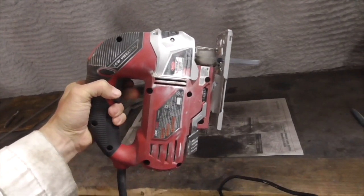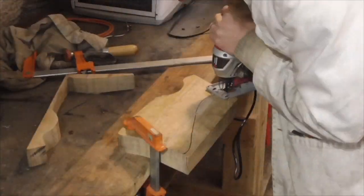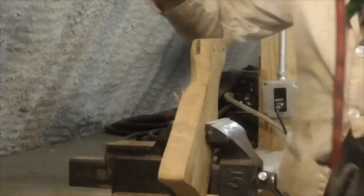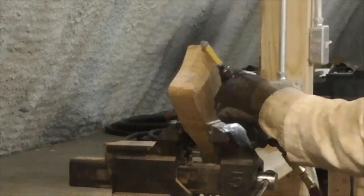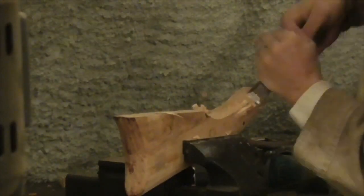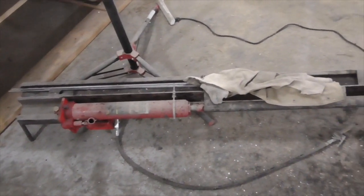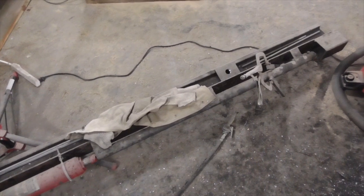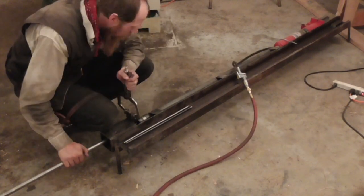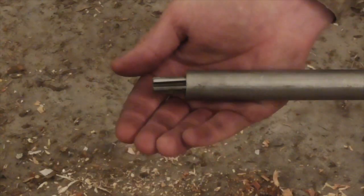If I want to make a wooden stock or something, then I need some woodworking tools. Usually I'll start by cutting out the profile of the stock with a handheld reciprocating saw, then carve the stock using a router trim bit chucked up in a pneumatic die grinder. Another option is to carve the stock using wood chisels — I've done that as well, and it's a little more strenuous but actually not that much slower. Probably the one significant piece of equipment in my shop that's somewhat specific to gun building is the rifling press that I built a number of years ago. It's basically just a special type of hydraulic press that I use for driving a rifling button through a barrel blank to produce a rifled barrel.